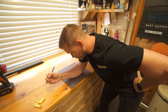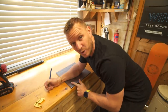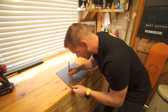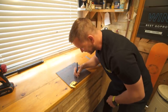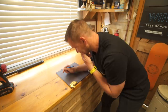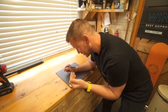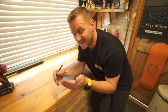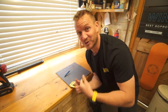The next step is the rear triangle, but before I start cutting the tubes and bending them into place, I'm going to make the dropouts for where these are going to bolt to. I've got this 6mm plate — I'm going to trace around this and add some bits so I can weld the tubes to it. I just need to cut two exactly the same. The hardest part is bending the tubes — it's getting hard now, really hard. I thought the front triangle was hard.